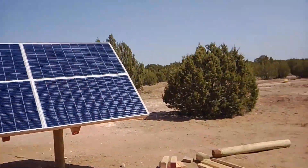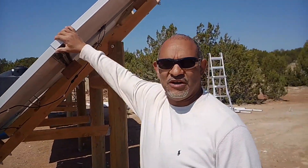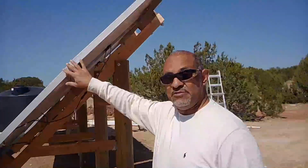These are the solar panels. Each one is roughly 300 watts; there are 12 solar panels, so 3,600 watts total. That's what's running our well pump — a three-phase, three-horsepower motor that's 900 feet in the ground, pushing water up vertically at 8 pounds a gallon. The system converts DC power from the sun directly to AC power, so I didn't need a battery bank and I never have to worry about buying batteries or them going bad. The pump motor is brushless, so there are no parts to wear out — conceptually this should last a very long time.